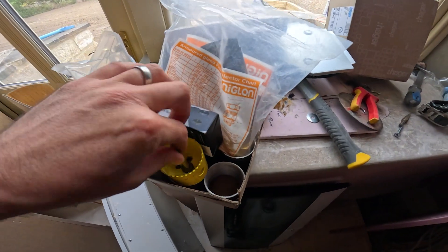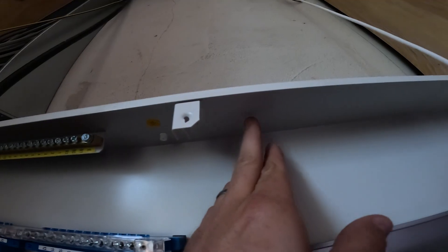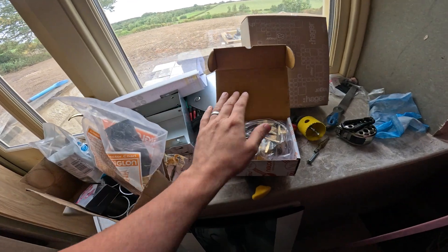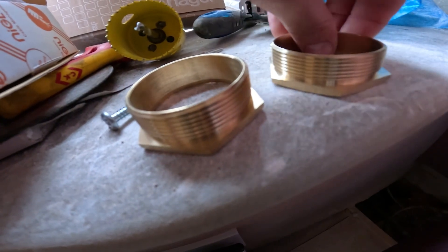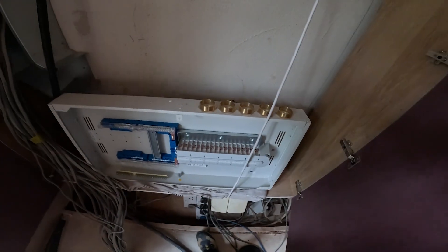We'll show you how to do that. We've got a 50mm hole cutter - we're going to put some 50mm holes in the side of the board, which should land nicely just past this little bracket. So there'll be five holes here for the cables to come in, and then we're going to cut the bottom slot out for a nice opening so some cables can come up and some can come through. The best way to do that is to get the actual lock nut, because you don't want these clashing. If you put them too close together they will clash as you try to tighten them up, so they want to be at least that much apart. At the same time it wants to look nice and equal, so we're going to position these on here - they should line up pretty good, and they should cut through and land on this trunking.